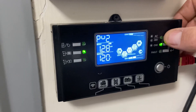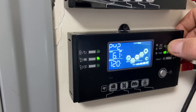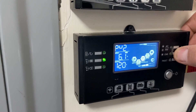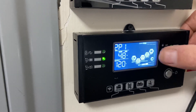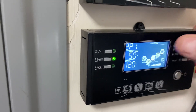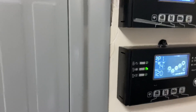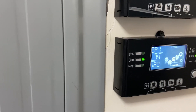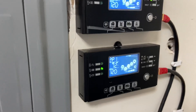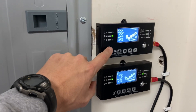You can also go up and actually see how many kilowatts the arrays are making each. So if you were to add those both up, it would be the same as — 48 or 50 amps times 48 volts. It's just easier to scroll up and look at the kilowatt values if that's what you're interested in. These units can each charge at 120 amps each at 48 volts.